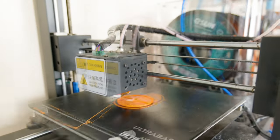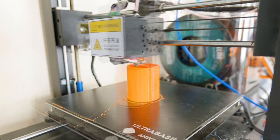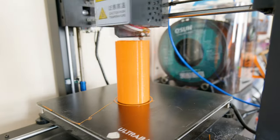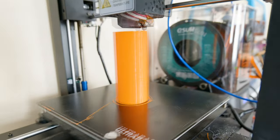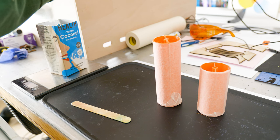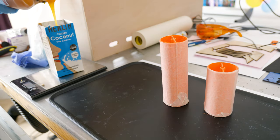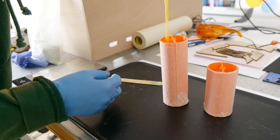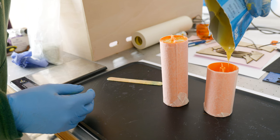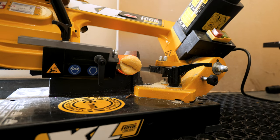I've opted to 3D print the inner core of the roller — a hollow core — and then, because I've got loads of polyurethane sitting around that I haven't used in years, I'm using it to infill that to make it a solid core. I'm also adding a little bit of chopped fibreglass just to give it a bit more strength and rigidity, though it doesn't really need it. Because my polyurethane is so old it foams up — water has basically got into it — so I've had to chop off the ends, which is a little bit messy.